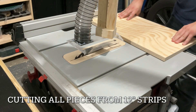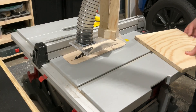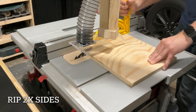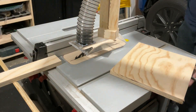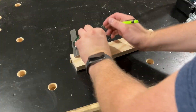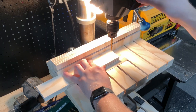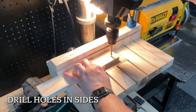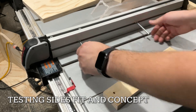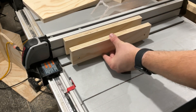Now this will vary a lot depending on what table saw and fence system you have, but if you have T-track on your fence, then the same concept should apply. I have to cut two side pieces for the carriage. These have to ride just above the table, so I'm going to be measuring to figure out the hole location for the T-track bolt. Before going further, I'm going to do a quick test fit just to make sure the bolts fit through both side pieces and they're lined up, and that neither of them drag on the table when moving around.